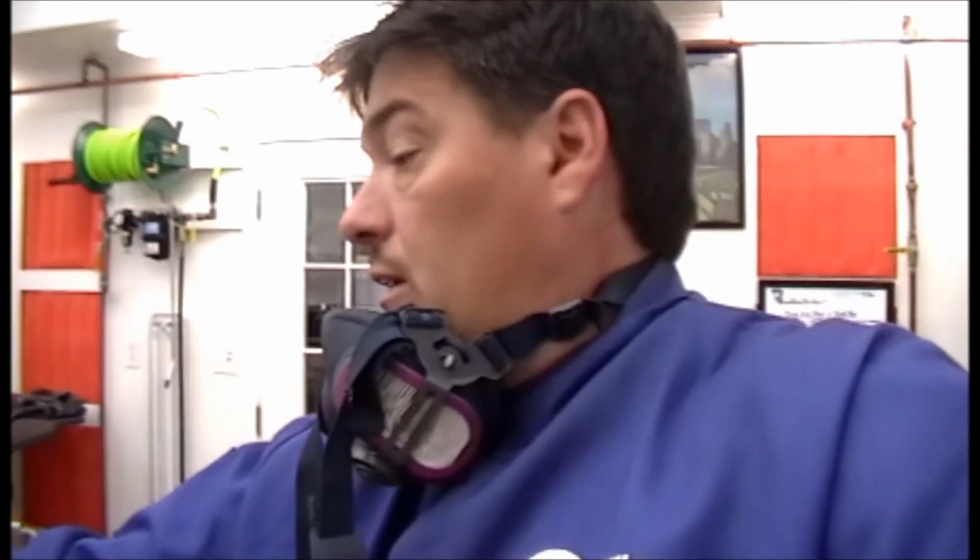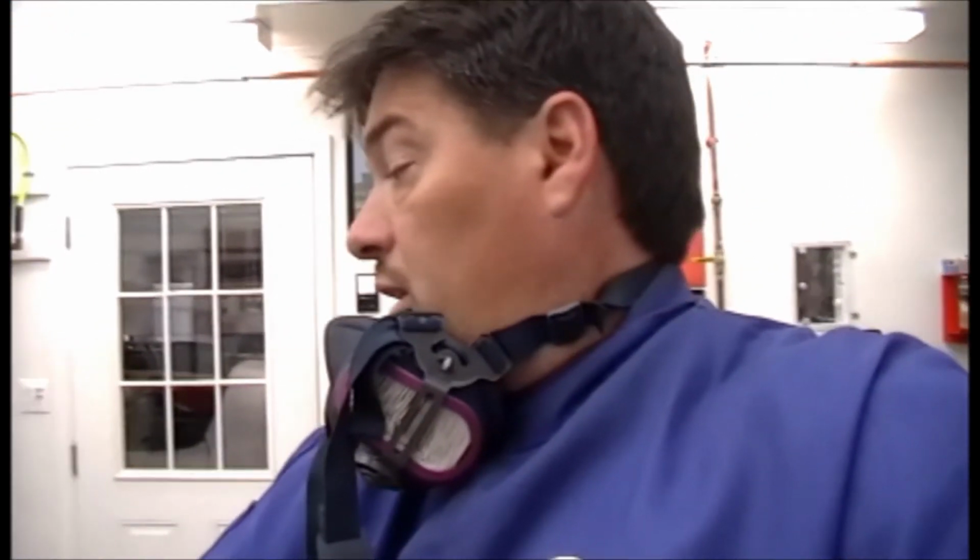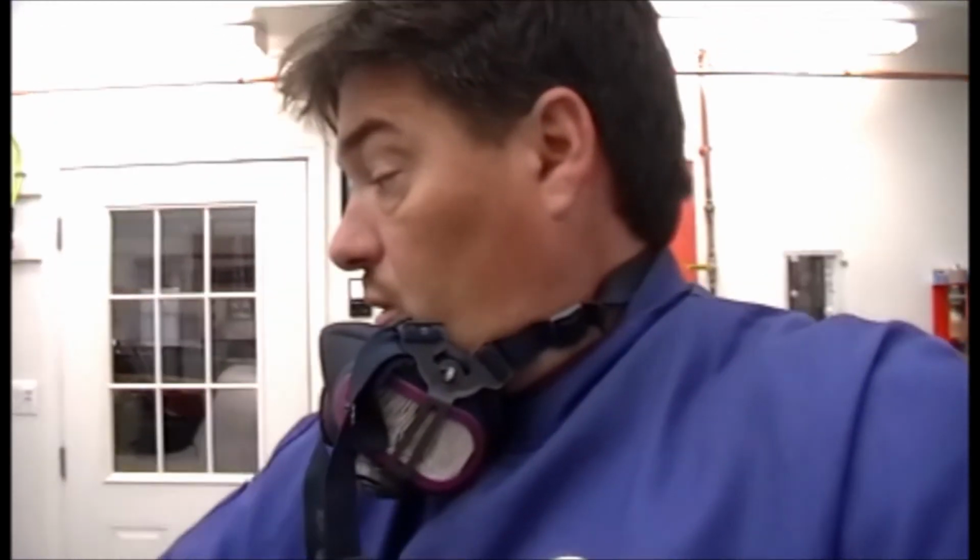Got the package tray mounted up to the package tray extension with some clamps. I've turned the welder back down, back to the settings where I originally welded the deck filler panel in. This package tray is definitely 20 gauge. And I believe that was my problem when I first went to weld to the inner quarter. It's pretty much 18 gauge. So I have to keep that in mind when I go to weld the outer quarters on.